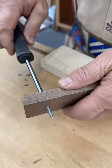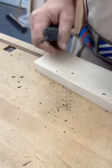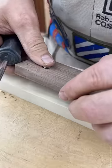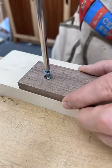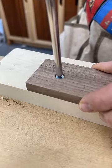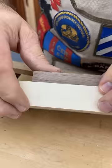Now the screw will easily pass through it — it doesn't bind in it at all. You want at least half, if not two-thirds, of the screw in the second piece of wood. When you screw it in, it'll pull tight in the bottom piece, pull the top piece down hard, and you get a great joint.